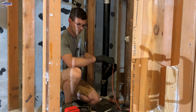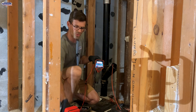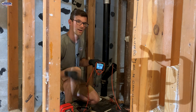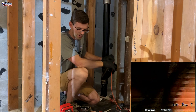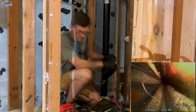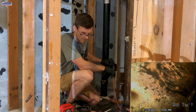So this is a 100-foot reel. I'm going to turn this on, and here's my camera display. With this, I can locate where the head of that camera is and how deep it is. We've got some water running upstairs that will help the camera slide a little bit easier. It will also count how many feet inside the pipe I am. And one cool thing is I can see where there's a fitting or maybe a Y — something else that comes into it.